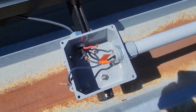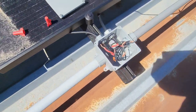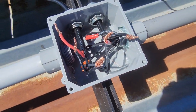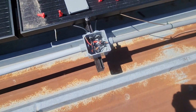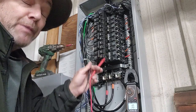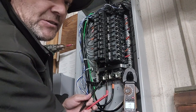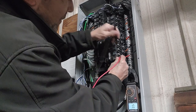Next step, just to make sure, I disconnect all the wires and go through to make sure everything's got impedance — but make sure you don't screw up putting them back together and cross any. Now to make sure there are no shorts left in any of these pairs, now that we know they're all paired up, you go through and you want to see it says overload — that's what we want in all of these.